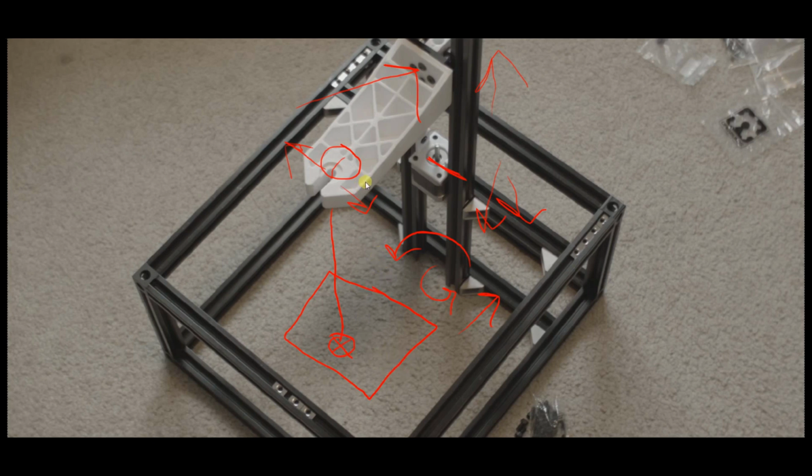But roll the gantry to the top, and actually I said to tape this earlier, but you may not want to tape this, and the reason is you want to let out some slack. So if you want to, just hold this with your finger lightly and let out some slack and let the weight further down, because this weight's going to lift up in the air obviously when you roll it up, and make sure that it still touches this. If it doesn't still touch the same spot, in other words, if it's shifted over here to the left or to the right, then you know that you have twist in these rails and you need to correct that.